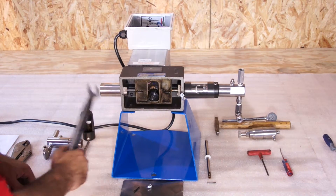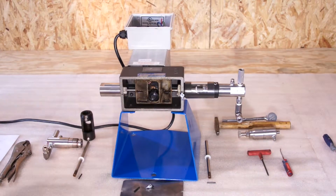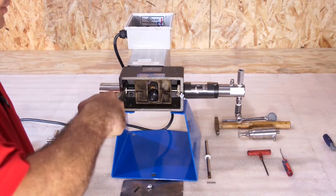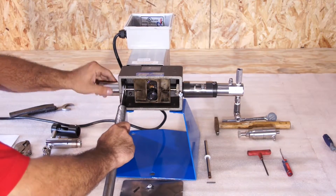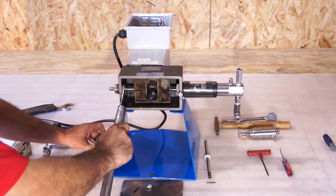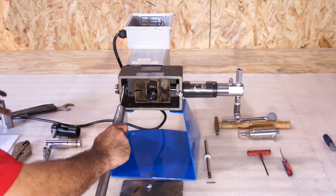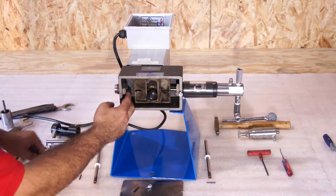Lay it aside in a clean, dry place along with your faceplate. Take your inch-and-a-quarter wrench to back up the bushing inside the housing. Use the other wrench to loosen the blind yoke, removing it by turning counterclockwise while bracing the bushing inside the housing. Remove your blind plunger and set it aside with your blind yoke. Make sure you do not lose the bushing.